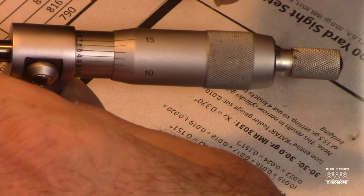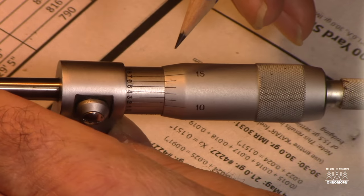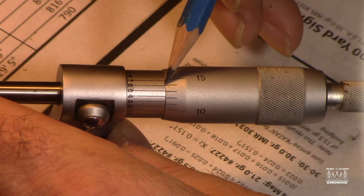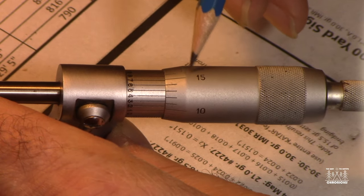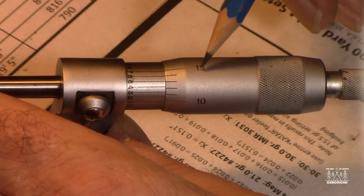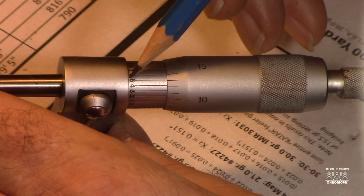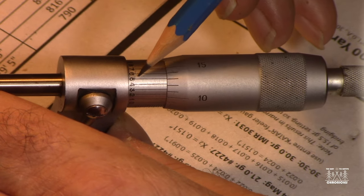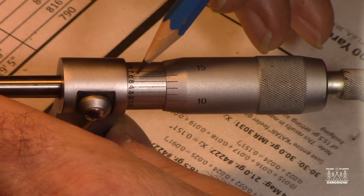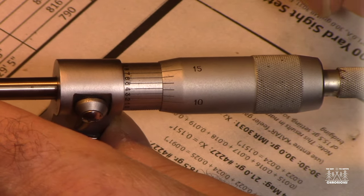And when I look at this, it depends a little bit on the angle that you're looking at from the camera, I guess, but I can see very clearly that this line, the six, lines up perfectly well with this line that's on the rotating cuff here. So that means I'm not using these numbers here, the 10, 15, 25, I'm going to use this number here, which is a 6. Not the 5, not the 7. They're both on either side of these lines. There's only one line that lines up perfectly, and that's the 6. So that's going to be my 10,000th mark.